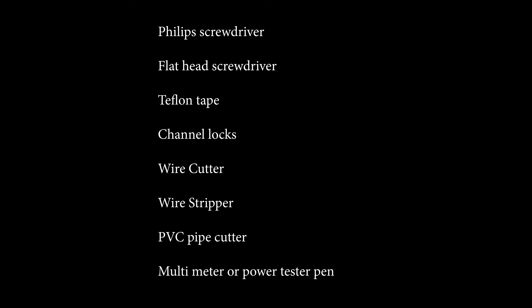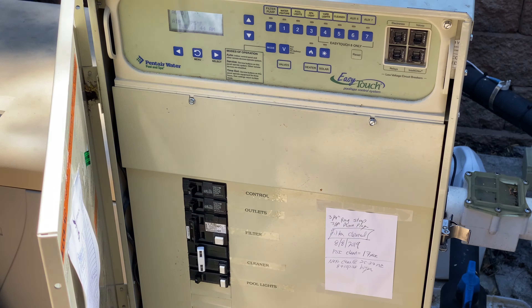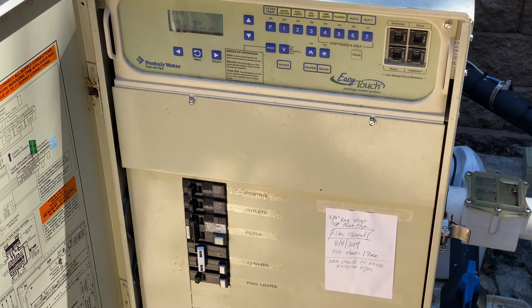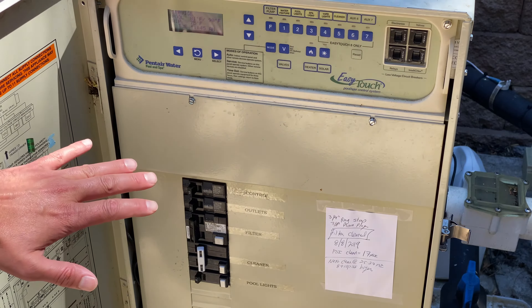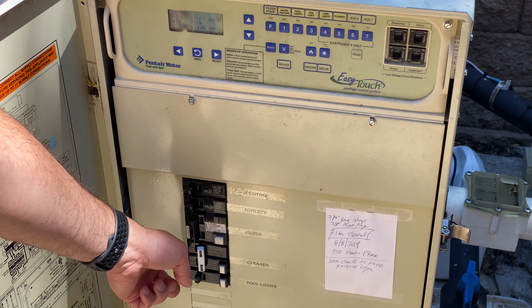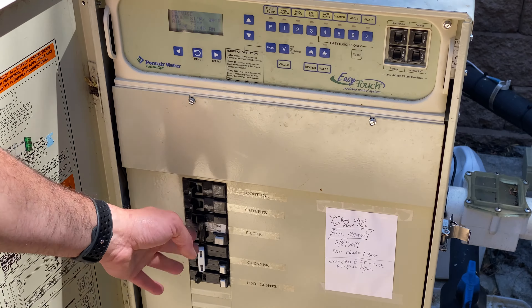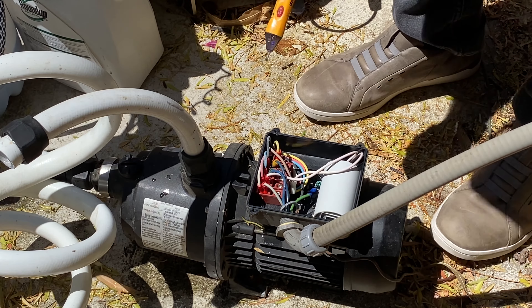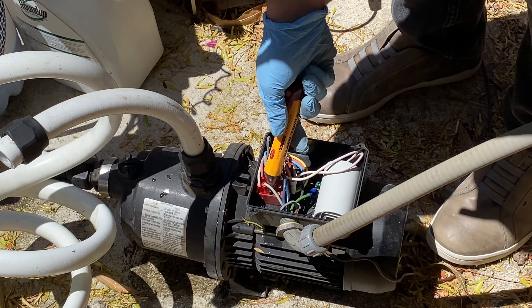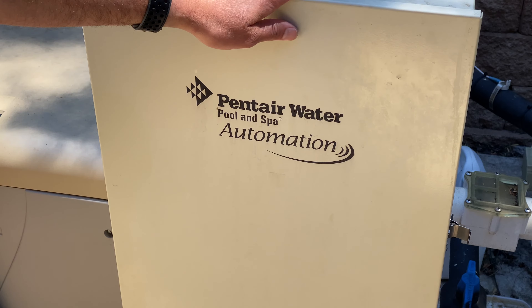I'll put a link below for all the tools I used. Now that you have a suitable replacement pump and tools, step two is to shut off the power and secure any circuit breakers from being turned back on. Start by turning off either your mechanical timer or, in my case, a digital timer — put the box into service mode to prevent the automatic timer from turning on. But take it a step further and turn off the associated circuit breakers for that pump, labeled 'cleaner' on my box, so it cannot provide power to those wires as you'll be touching them. You can even turn off the circuit breakers leading to your entire pool equipment from the house or from the street. Also close the timer boxes and put a note on them so a family member or kid doesn't accidentally turn them on.